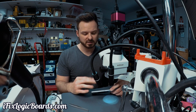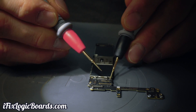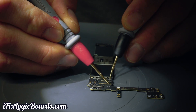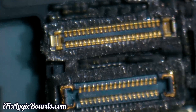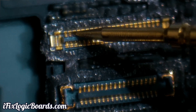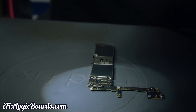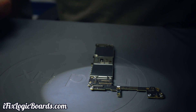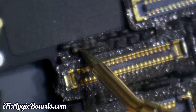I did open it up just to see if there are any water marks and it looks clean, so let's open it up and see what's going on. The first thing I like to do in a no-video situation is to just run a lead across the pins here — ground on ground — and none of these should beep. We already got a beep, so this one is shorted.